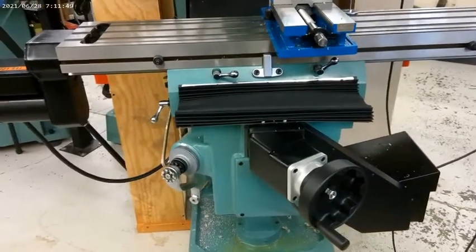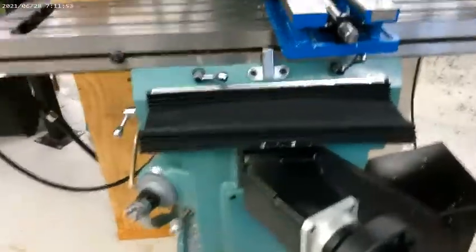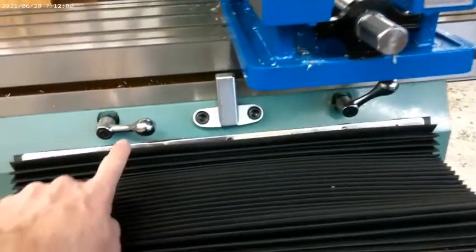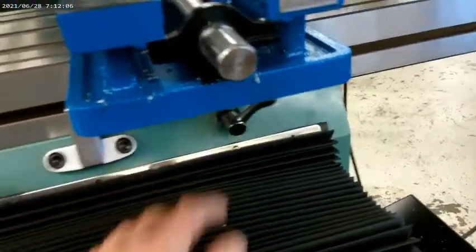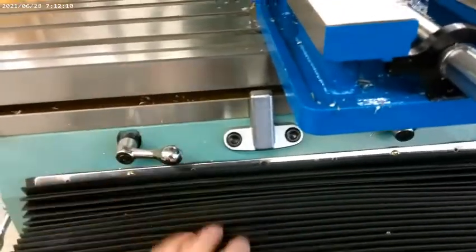Before we move any axes, we have to make sure that our locks are loose. So we're just going to zoom in here in the front of our table. If I back up, you'll see this is our machine. Right here is our X-axis lock — that's our left to right lock. There's one here, make sure it's loose, and there's one here, make sure that's loose. To tighten them, all we have to do is snug them down a little bit to the right, or loosen them to the left.